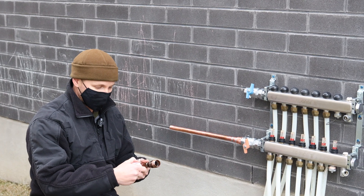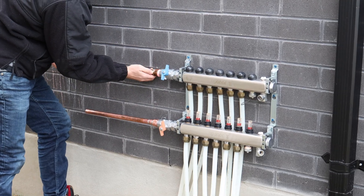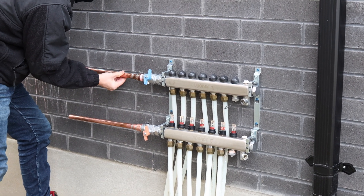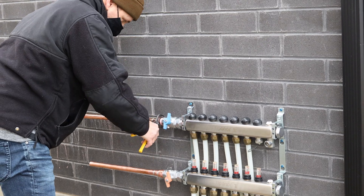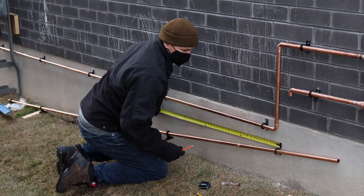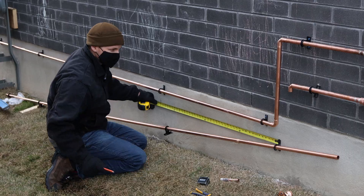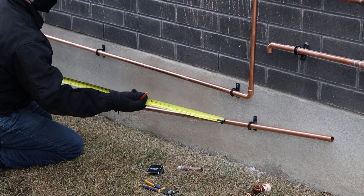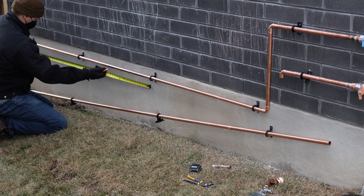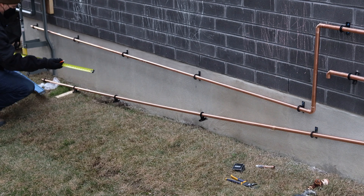With the T-tape you want to make sure you put it around the right way so it doesn't come unraveled — make sure you start on the bottom. We're just measuring out 42 inches here for the ring stays. Then we're dry fitting the pipe, just making sure you're maintaining a slope.